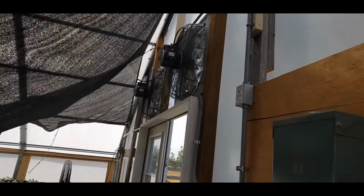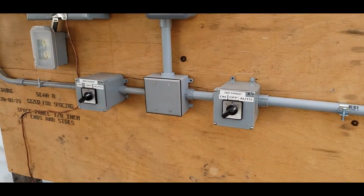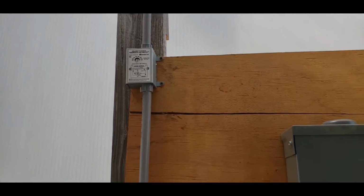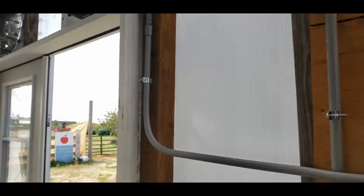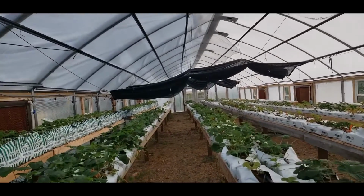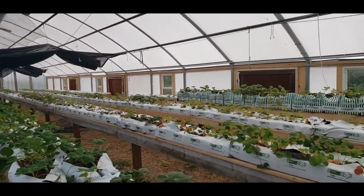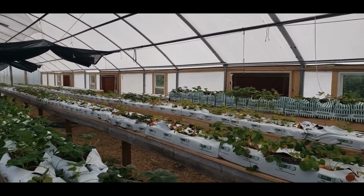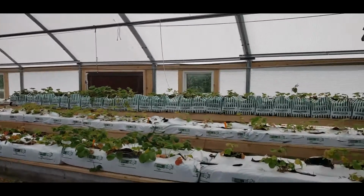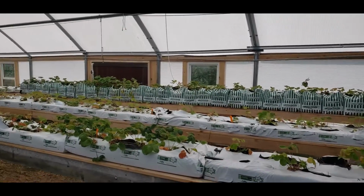These are the exhaust fans, one on each end. And then the auto position, like I said, is again controlled by that thermostat. There's a thermostat on each end. So in the morning, the east end gets hot quicker and it turns on. And then about a half hour later, the west fans catch up and the temperature gets hot on the west side. So there's tremendous temperature variation between north and south side, east and west side, which is why the circulating fans are so necessary.